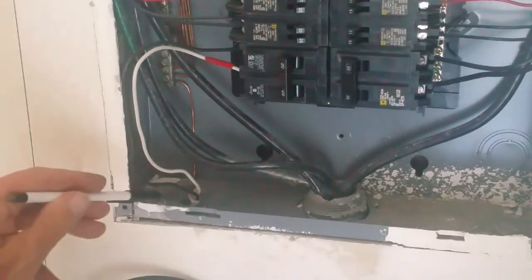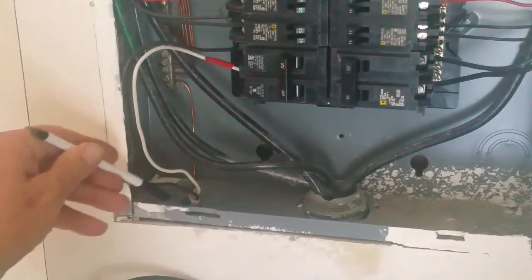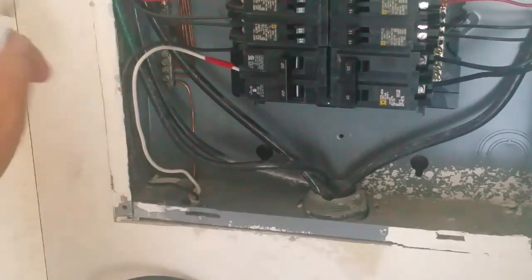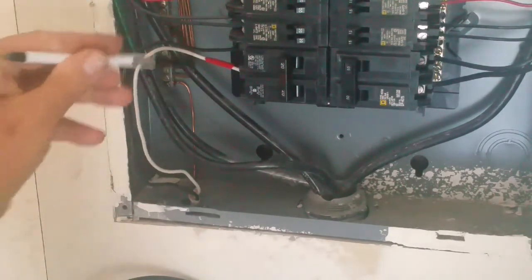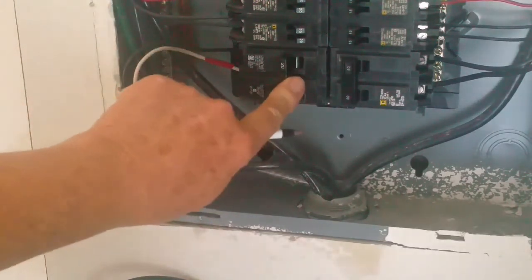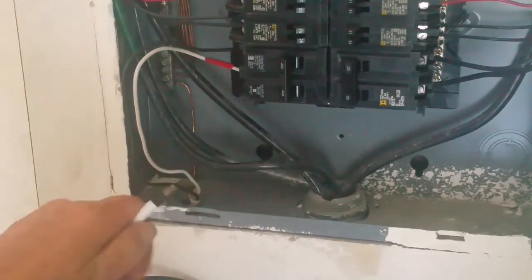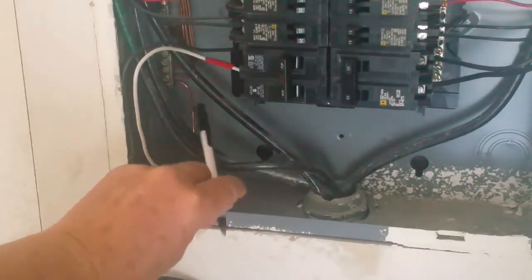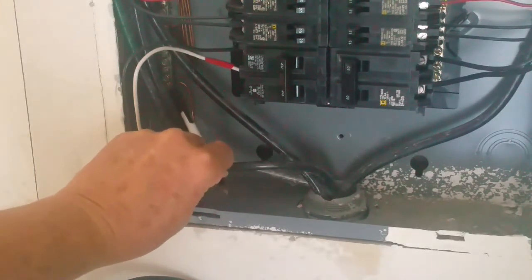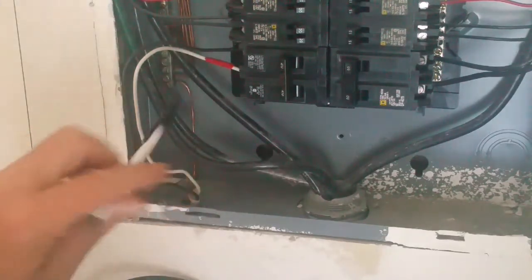You'll see this is where the Romex comes up from the plug. This is our cable clamp here. We've got two wires, one going to each pole on the breaker. Just make sure the breaker is off — even though this is off, turn the breaker off to make sure. And then back in here you'll see the ground wire, and that just screws in with a screwdriver. It's nice to keep these somewhat organized, and notice that this is a red wire.